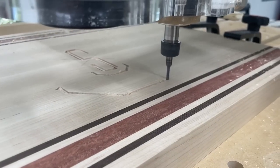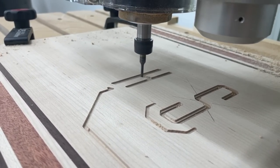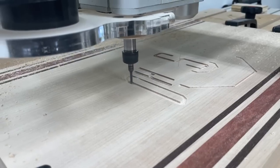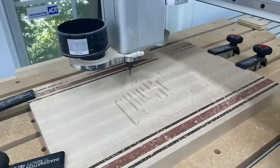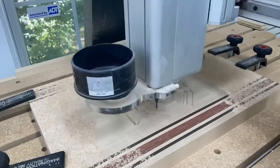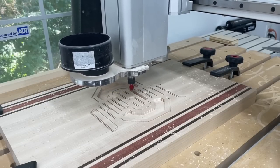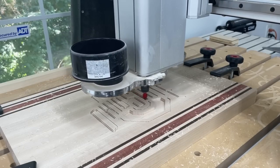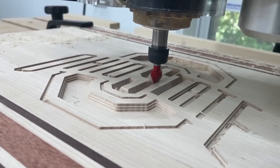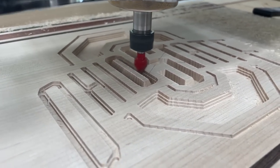I've never even made a cutting board before, so might as well try a technique I've also never done and potentially ruin it, right? To make this board really awesome I wanted to try my hand at a v-carve inlay with the Ohio State logo. I'm not a CNC expert, so I found a great clear and concise 10-minute video from a channel called Greg's Garage on how to set this up in V-Carve Pro — I'll put a link in the description. In simple terms, I'm carving the logo into the cutting board and then carving the reverse mirrored image into other colored pieces of wood to lay back in and refill the cutout. I'm first making a clearance pass with a Freud eighth-inch or quarter-inch spiral down-cut bit, then following that up with a 60-degree v-bit for the final edges and sharp points. I'll leave links for these bits in the description.